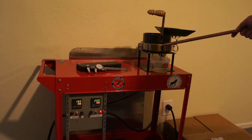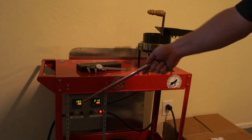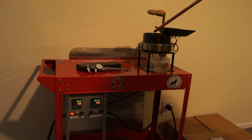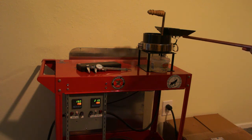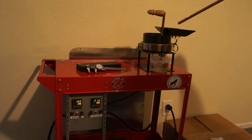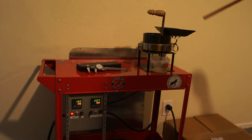The main pot with this heater is on its own controller, as you can see over here. The temperature probe is away from the heater, so it's really just detecting the fluid temperature. This other heater up underneath here has the temperature sensor right with the heater, just because I never know how much lead will be up there. I just wanted the sensor to read the heater to protect it.